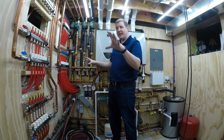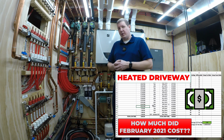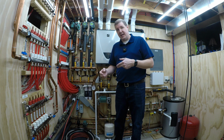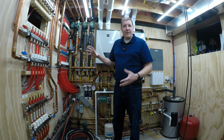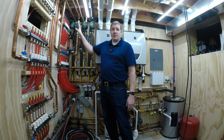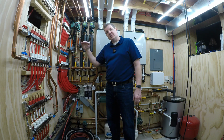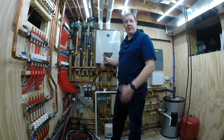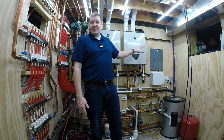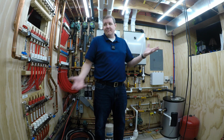And once the whole thing is brought up to temperature, it gets into a rhythm, and you'll see this, and I can put a link down below to one of the other videos. It's like a 15 minutes on, 15 minutes off cycle. So the heaters will come on, run for 15 minutes, pump a bunch of heat out there, and then the heaters will shut off. The pump stays on, so the driveway is always circulating, but it doesn't need more heat. So it'll slowly lose its heat. 15 minutes later, it'll fire the heaters, add more heat, and it's more efficient that way. You're not running these heaters non-stop for hours on end when really they only need to be run twice an hour. So it's 50% savings over running it.